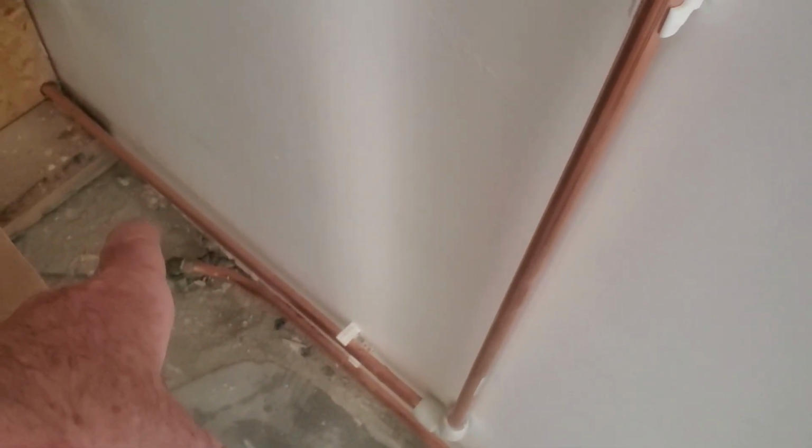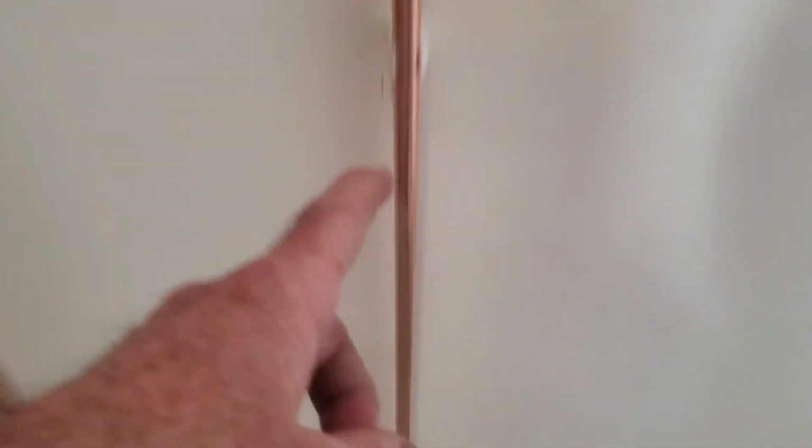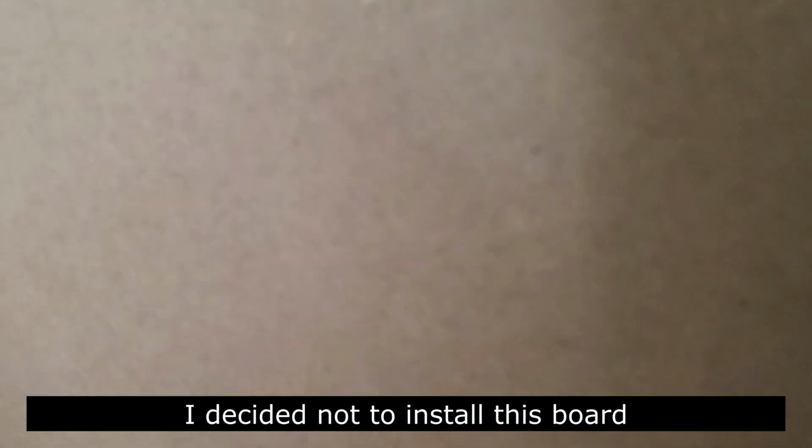And then that's where the pipes came out of the floor. There was a radiator there, a wee small radiator when I moved in. I disconnected it, it wasn't doing nothing. So I have tapped off that, brought the pipes a long way. I've measured out 600 mils right here. That's roughly what a wardrobe would be. So nothing's going to touch these pipes. That's to give heat off inside the wardrobe. I'm about to put this board on now. I'll move this board a minute.